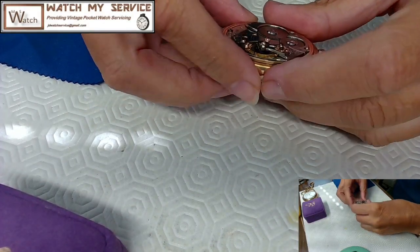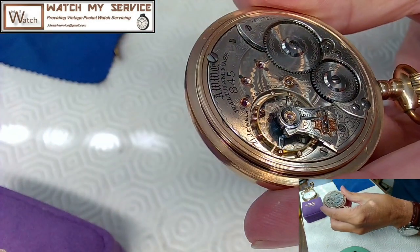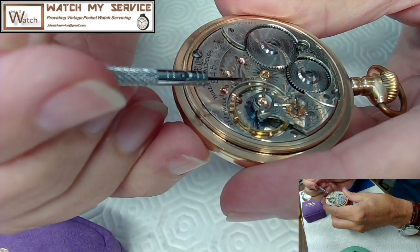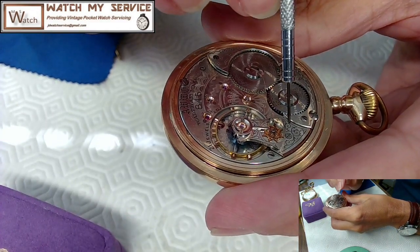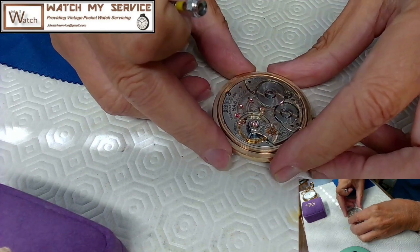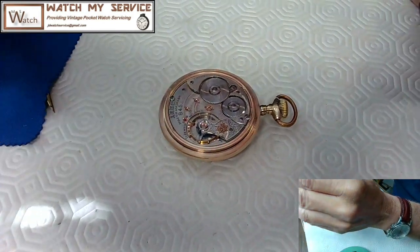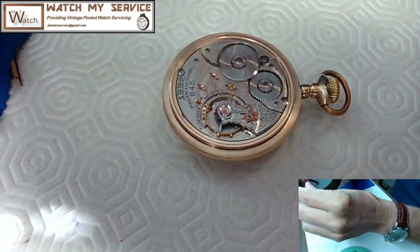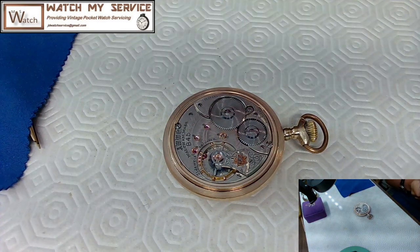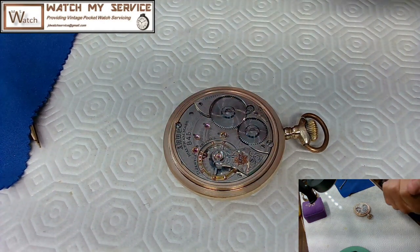I'm back. The first thing I'm going to do is loosen this very small screw right here — that should allow me to drop the hairspring down, which will help when I unscrew the balance cock. I can just lift it up and the balance will be sitting there. It's probably the safest way to do this. Let me arrange the camera. I'm doing this live, unlike guys like Wristwatch Revival who spend hours producing their videos.